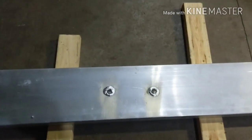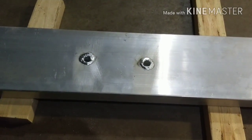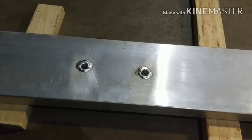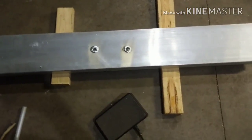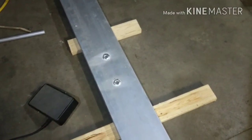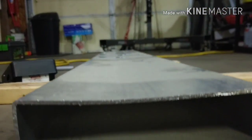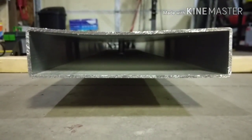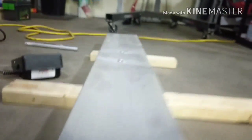Alright, so I buzzed in a couple of supports with the TIG real quick. It's been a while since I welded, so I figured this would be a good spot to practice — or get refreshed. I welded some tubes in and they go down to the other side. That will allow some support so the tube itself or the transom cannot be crushed. I'm going to grind that flush and throw this in the boat. You can see those tubes — that's crush support, that's what that is.